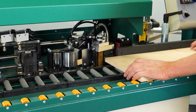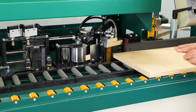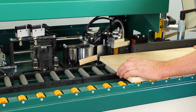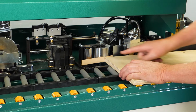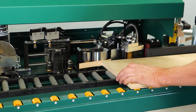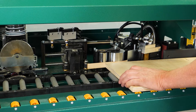As we're moving forward you can see the tape coming out here in the front, being advanced by that rubber wheel. As the board feeds forward with glue applied to its edge, it makes contact with the tape which is applied to the edge of the board. This is our flexible pressure roller — it moves forward and back, spring-loaded — and then the second one is a stationary roller.